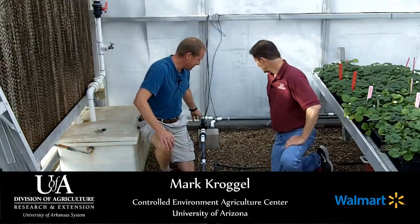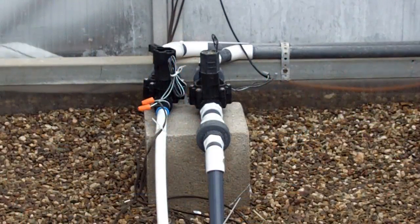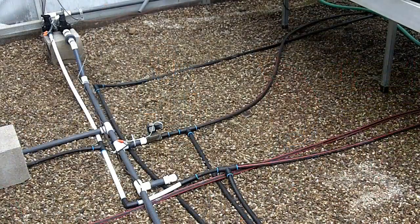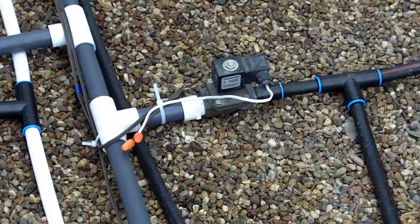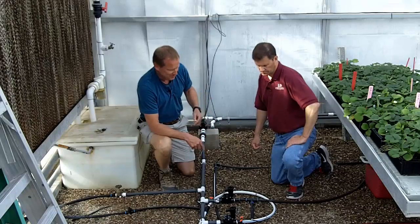We have the line coming in. We have a master valve that just turns on when any of the valves are called to turn on. And then we have individual valves for our different treatments. We have three lines because we have effectively three different treatments out in the crop. So when the irrigation controller calls for irrigation to happen, it turns on one of these solenoids — and also the master valve. One solenoid at a time will run based on an irrigation controller that sends an electrical current to turn on a solenoid.